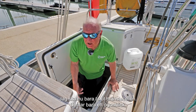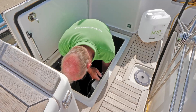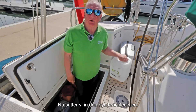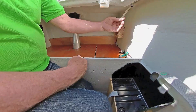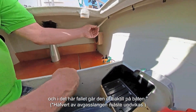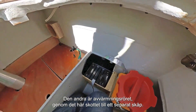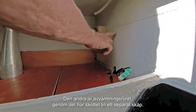I'm now just going to take the fuel cell out, it'll only take a moment. This is three or four generations old and now we've put the new fuel cell in. We have the advantage here that the fuel cell has been in before — the vapour line has already been installed and ducts out to the back of the boat. The off-heat tube comes through here through this bulkhead into a separate locker.